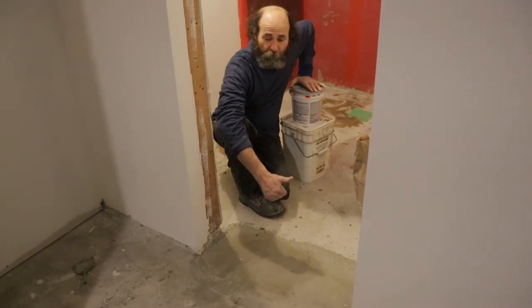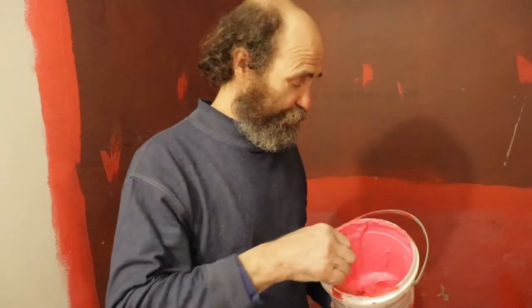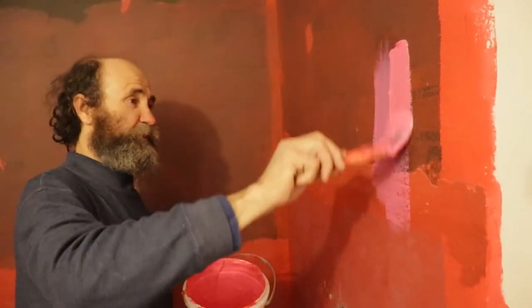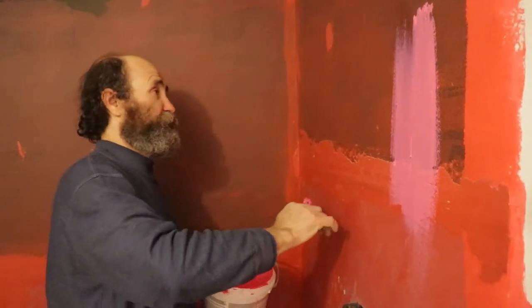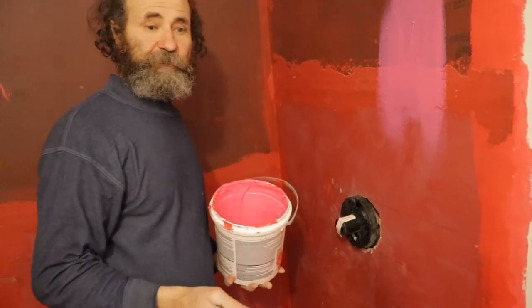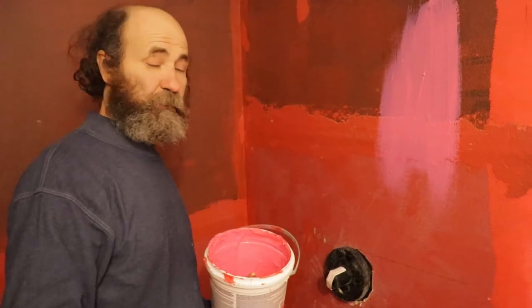This process worked very good. I've done it quite a few times and never had a problem again. So we didn't show you guys how to use the red guard - we're just gonna do a sample here, it's very simple. All you want to do is pretty much just brush it on or roll it on. This one we just rolled it on, but you can go with the brush. When I used the cement patch I used a paintbrush because it was a small area and I could not use the roller. I use two coats of red guard to make sure it is forever sealed. Once you use two coats on the concrete, you make sure that all areas are covered and sealed - continually sealed without any water penetration. Since we broke the concrete, we have a lot of bumps and holes, so just make sure with the paintbrush that the red guard gets into those holes and gets them sealed. Make sure it's nice and clean - the dust would prevent it from holding good.